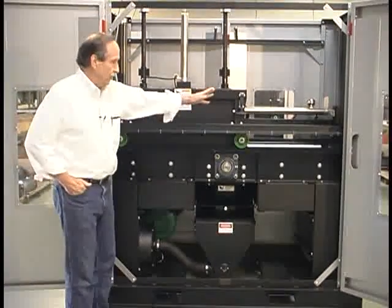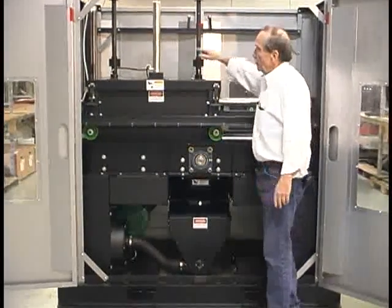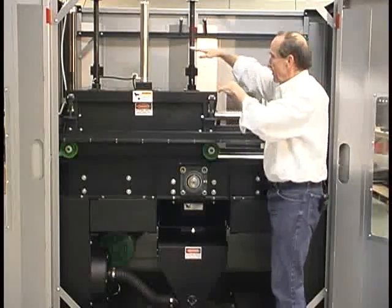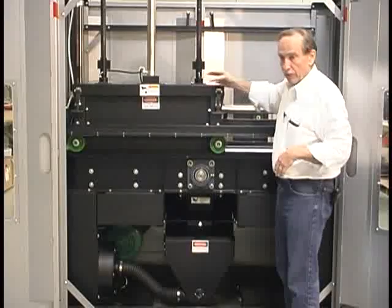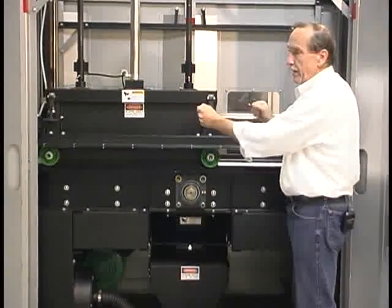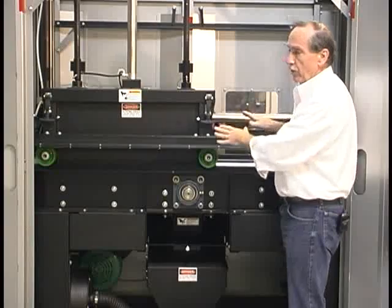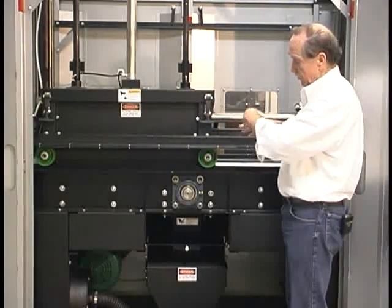Let me talk briefly about the way we move this box back and forth. We have what we call an air-over-oil system. We have a hydraulic cylinder back here full of oil, and we have two cylinders here that are reservoirs, half full of oil, and we place air pressure on those reservoirs. In one direction, we drive the oil down on that reservoir and cause the cylinder to push the box this way — but it's oil that's moving the box, in this cylinder. Then in the other direction we reverse the air flow. We use oil because we get very uniform, steady, controlled movement, which you would not get with air. But we use air because we don't want to include a hydraulic pump, which is unnecessary in this case. We're only using the oil to control the movement of the box very carefully, so we get nice uniform feeding over our planer blade.